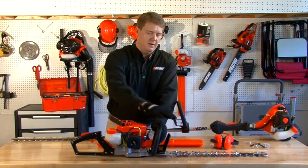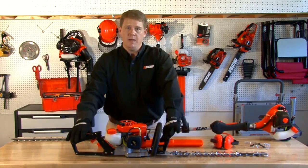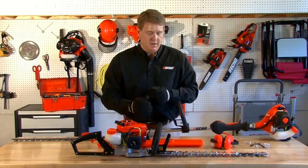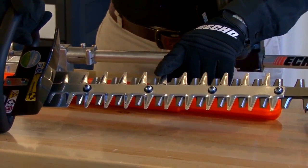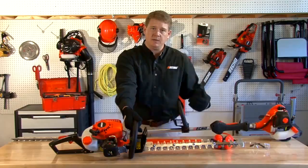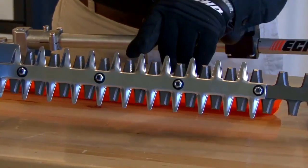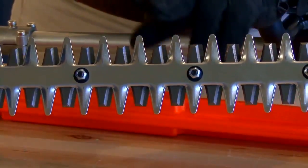Let's talk about the front handle. Your left hand is going to be the closest hand to the blades, and you want to make sure it's fully protected from the blades in case your hand slips off or if material comes back. This model also has a blade guard — this not only protects the blade from too large of material entering the blade, it also protects if you brush it against your pants leg or arm. The tips extend past the blade, so they will actually stop your leg or arm from getting into the cutting area.